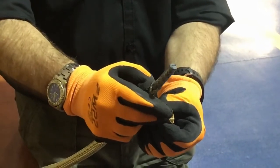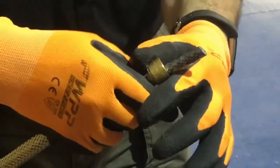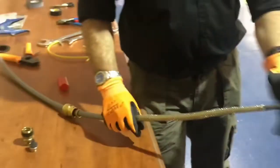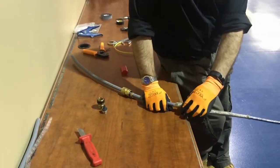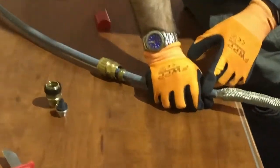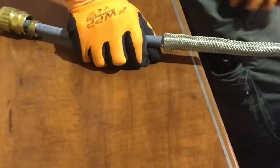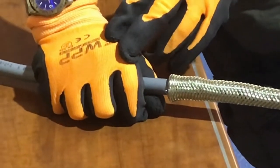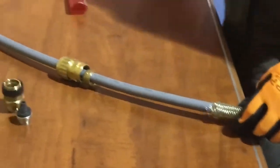The reversible armor clamping ring goes on with the thick end upwards. You have a thin end and a thick end — the thick end must be there to trap that braid. Push this back down. You can do it one of two ways: you can over-push it so it comes up here and then trim around, or you ease it down and trim around to get your 20 millimeters.